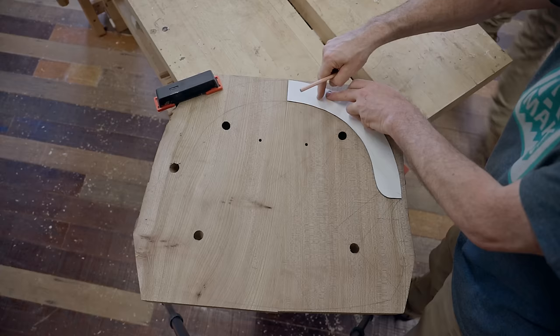To do that, this time we're using two mirrors. It's pretty much the same setup as the lasers. One to keep the drill upright in one direction and the other to keep it at the correct angle in the other. You just need to keep your head still. I think I prefer this method. It works very well. You can clearly see the depth marker on the drill bit, where with the laser, you're just looking on the top of the actual cordless drill.